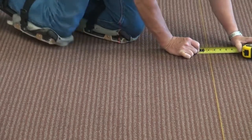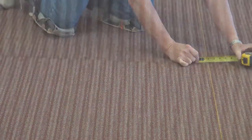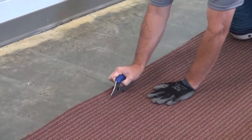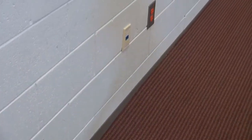This is not within manufacturing tolerance. Can this carpet be installed in an acceptable manner? Absolutely. By row cutting the selvedge edge and butting the carpet to the wall, then cutting across the width on pattern, you can clearly see the amount of pattern correction needed.